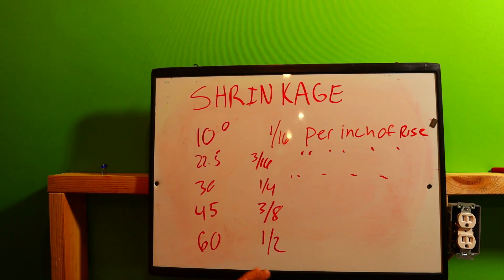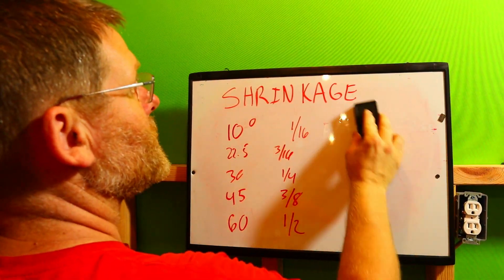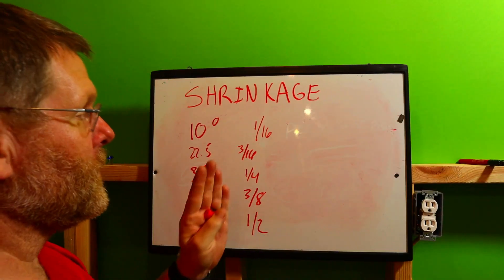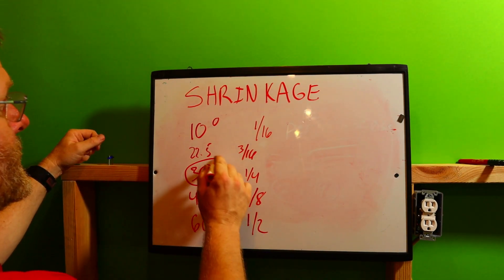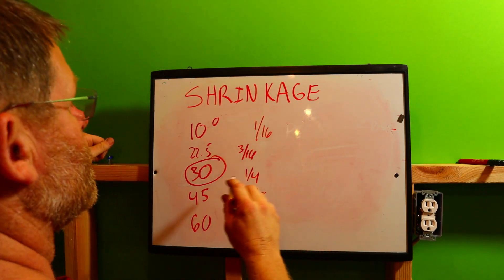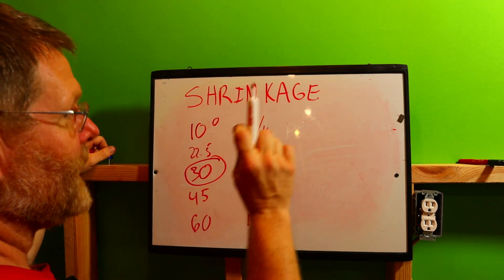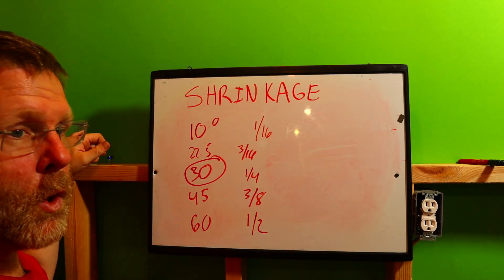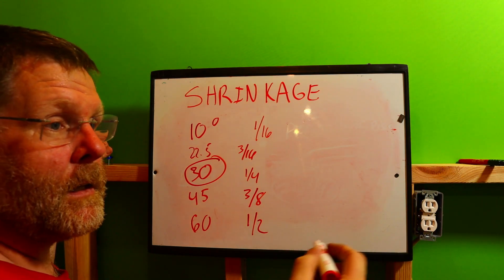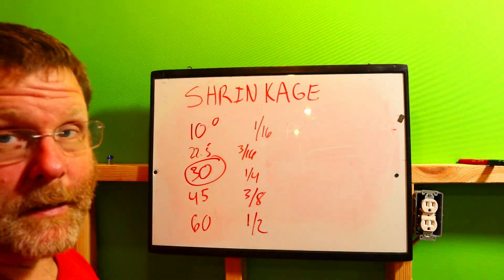That's how much you're going to lose on your pipe. Let me explain this: we're going to talk about the 30-degree bend. At a one-inch offset, you don't have to add a full quarter — that's just for one inch of rise. And we're going to do it at four inches as well, since that's what this segment series has been about — the four-inch offset from 30 degrees all the way to 60.